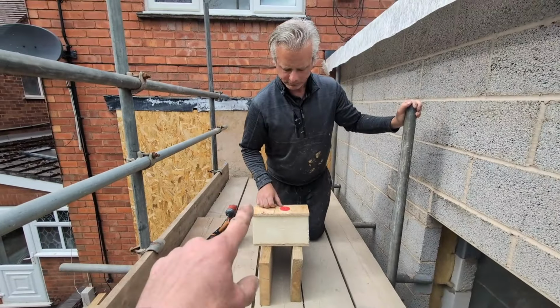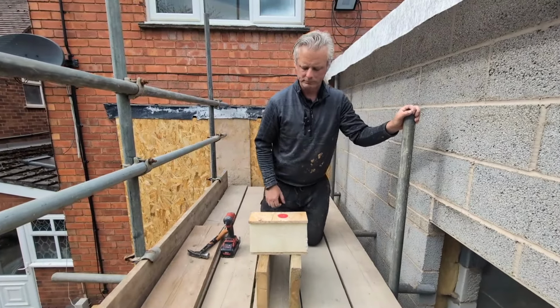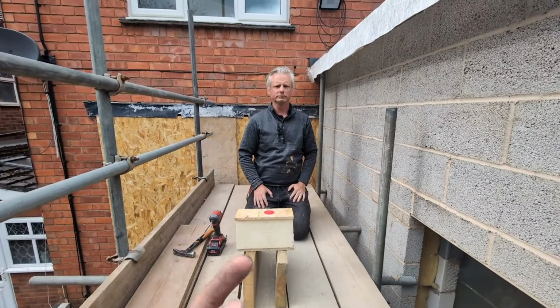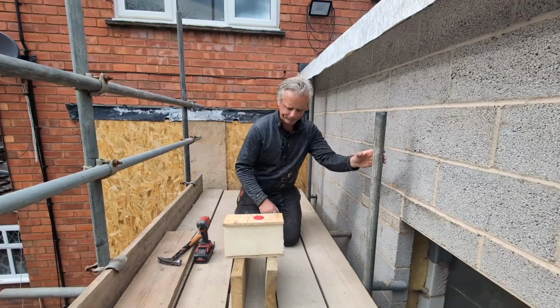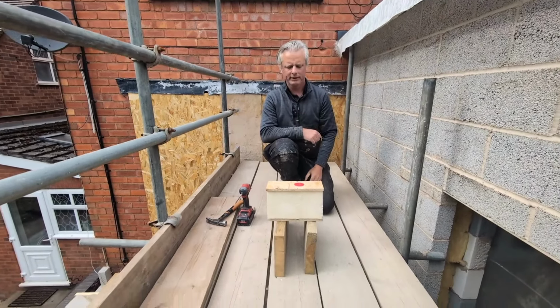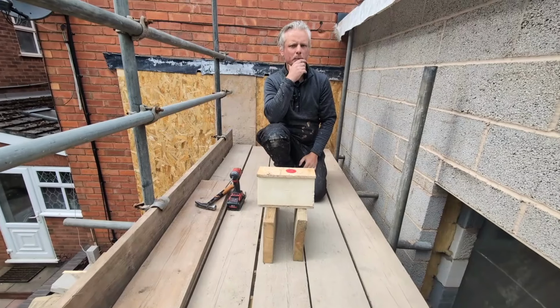Because like you say, you've got metal going all the way through, puncturing into that void between your rafters, and you've got loads of cold, then your cold metal, yeah. Heat hitting the cold metal, is it going to form condensation? You don't know, do you? So no. This way, we think, is just...